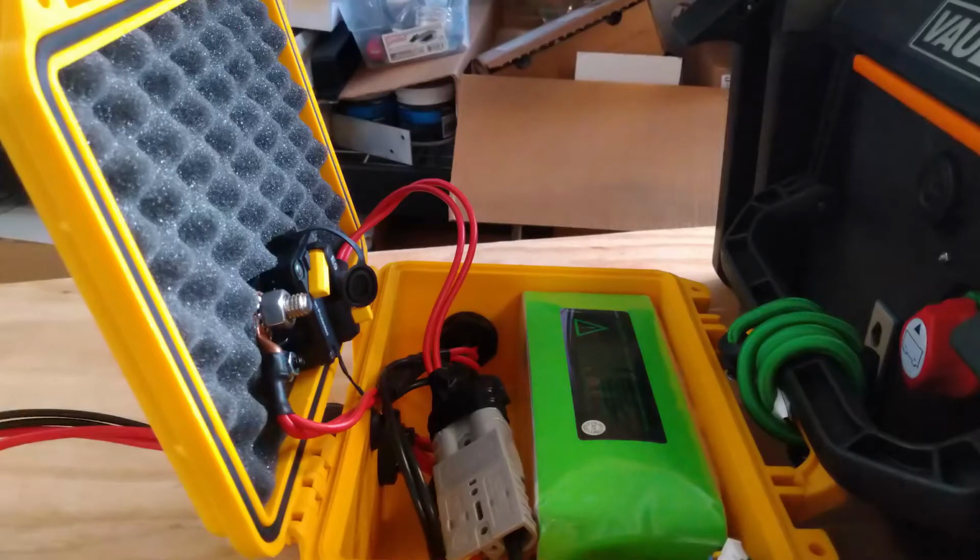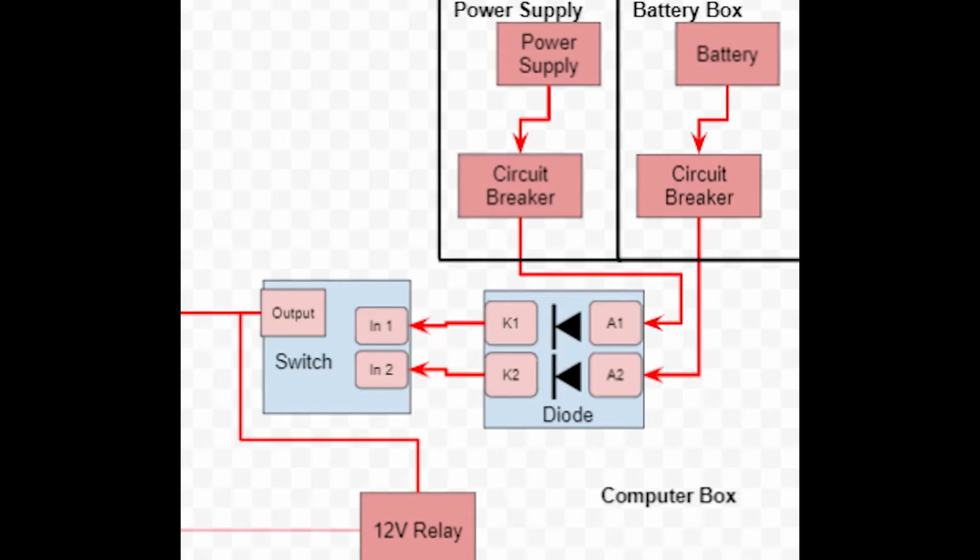One of the things that we are most proud of in the box is this rotary switch that we use for batteries. If you recall correctly, last year we had something similar, but this year we expanded upon that and have a better product. Last year we didn't have diodes, so there could have been an issue if two batteries were plugged in at the same time for a long amount of time, with the current flowing back into the battery, and this was a safety concern.